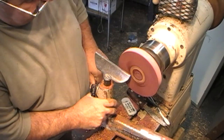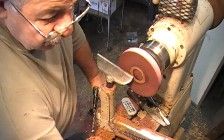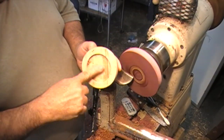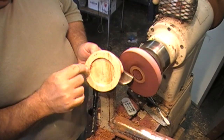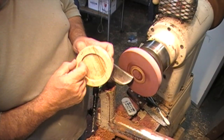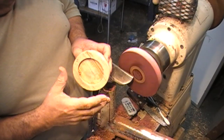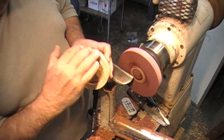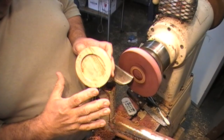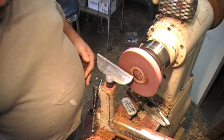Pop quiz — do you know why that circle's there? Because my glue block had a depression in the center, so that it only had about a 3⅛-inch band making contact with the glue. Why? Because the glue block moves too — it's wood; I rely on it to move and flex. I had it oriented with the grain, so if it moved, it moved this way or that way — everything was the same. And then I didn't use as much glue, and when I took it off it was easy to remove.